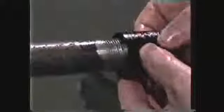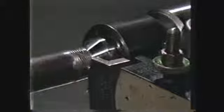Now check the threads with a taper thread gauge or try the mating parts when a perfect thread appears to be forming on the small end of the taper. If the mating part screws onto the work approximately 4 threads, or the length indicated for hand-tight engagement in the Machinery's Handbook chart, the thread is to size. For a 3/4 14 pipe thread, the length of hand-tight engagement is 339 thousandths. If the mating part will not screw onto the thread this length, lubricate and continue machining until it will do so. The mating part screws onto the tapered thread the specified length, so this part is finished.